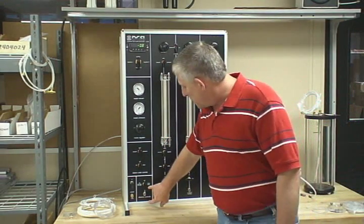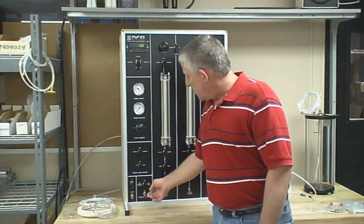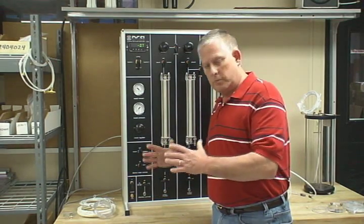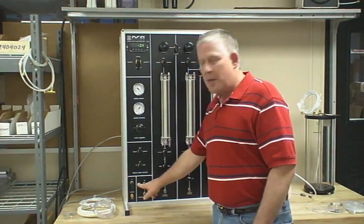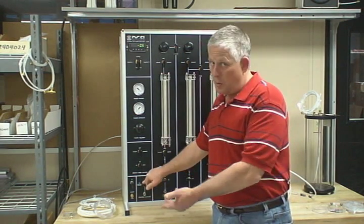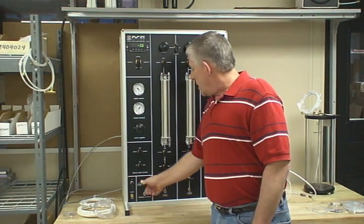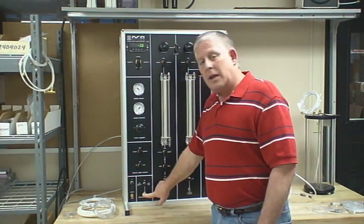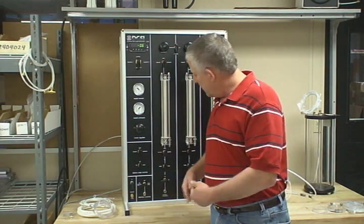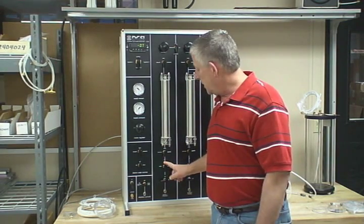The chamber controls are quite useful. They are used to fill the chamber with tap water — the external part of the chamber, your confining pressure. Don't normally use de-aired water because it's so hard to come by and it's not necessary for your confining. You have forced drain, which will allow you to force the top of your cells and force the water through the drain, which I will show you shortly.